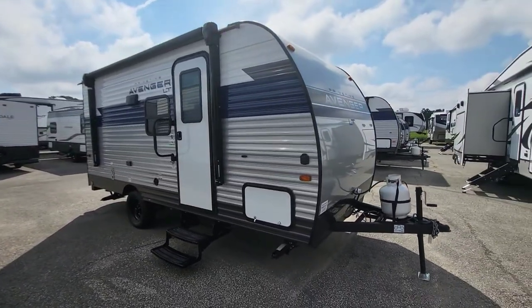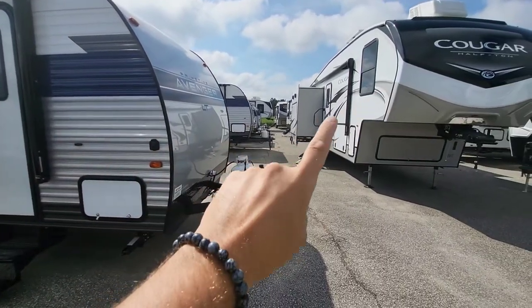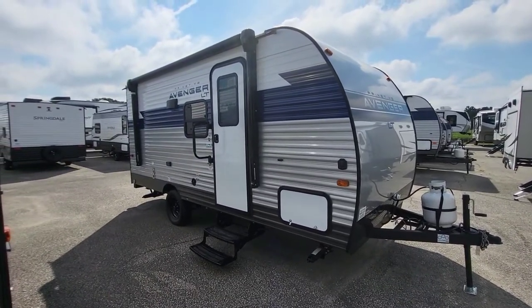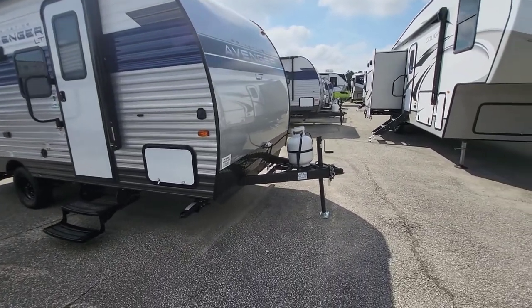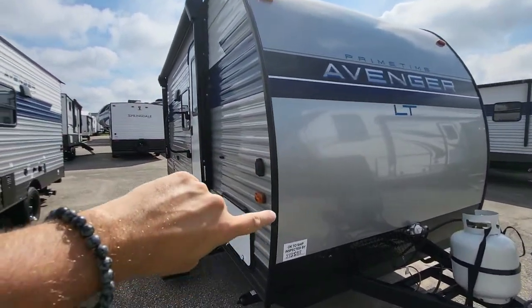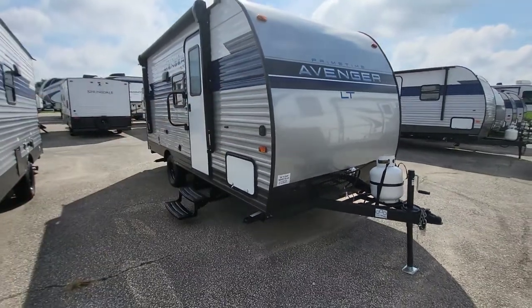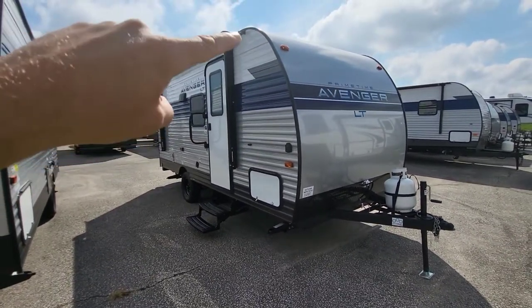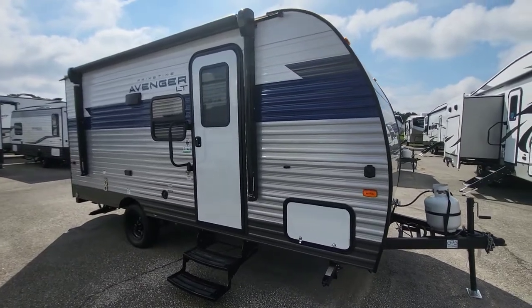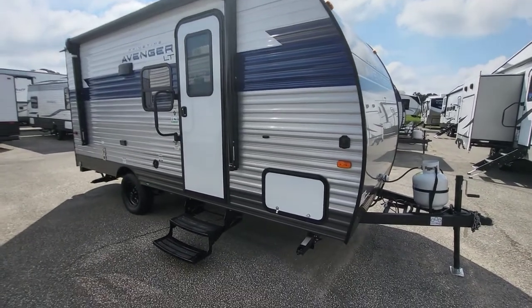Your price is also going to be a little more economical. Once you move away from a smooth wall like this Cougar, you're going to go to a corrugated, which is fine. We have a wood substructure frame. In this case, still LCI laminated front wall - they put hurricane straps up on these edges too, so these are strapped, sealed, and then you have the cap on top. A lot of people worry about water - we still need to watch our seals on top, making sure our sealants are good, roof is clean, everything is caulked. Any seams you see, redo that caulk every so often or just have it inspected somewhere you trust.